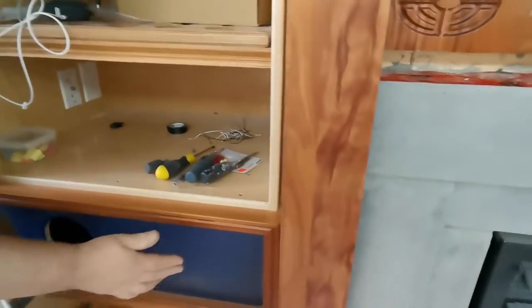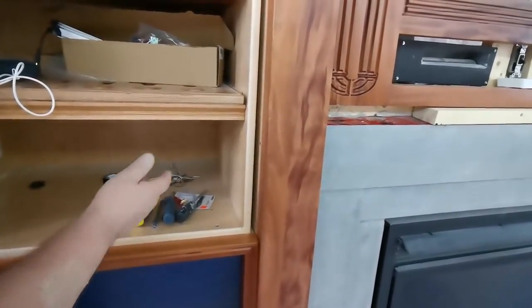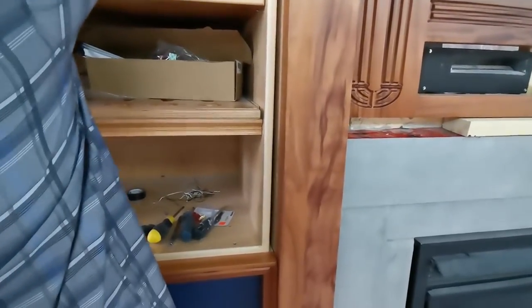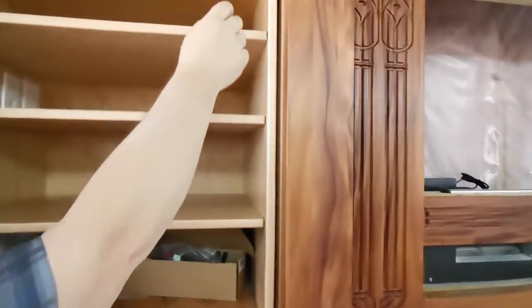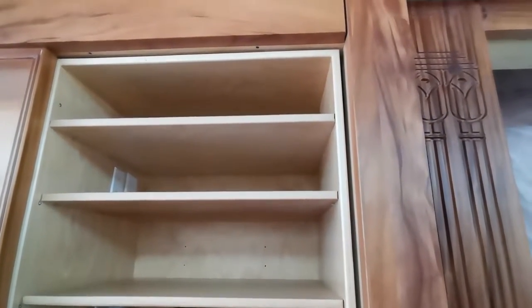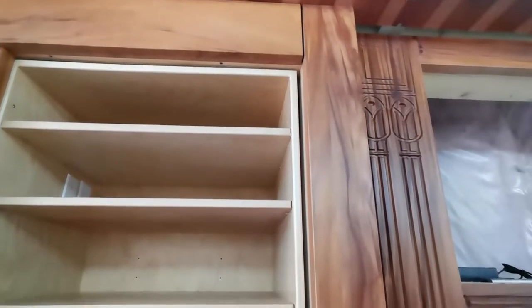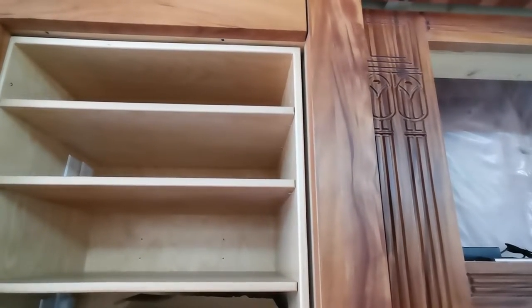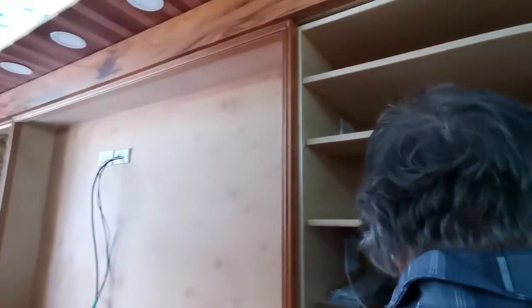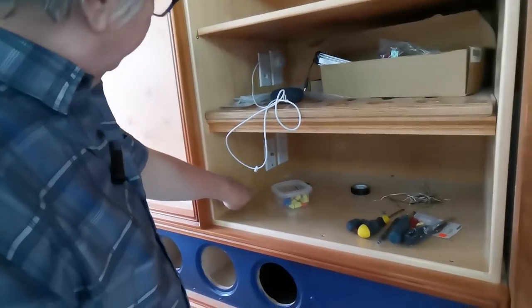That's why I'm not torquing this in when I screw it. I might have to pull that. I can see where my V is right here. So I might have to go in behind here and just pull it out ever so slightly. These things can be a little tricky to get that really nice reveal. But I am liking the 3/4 reveal. It does look nice. And the screws are not going to be buried. These screws are all here.